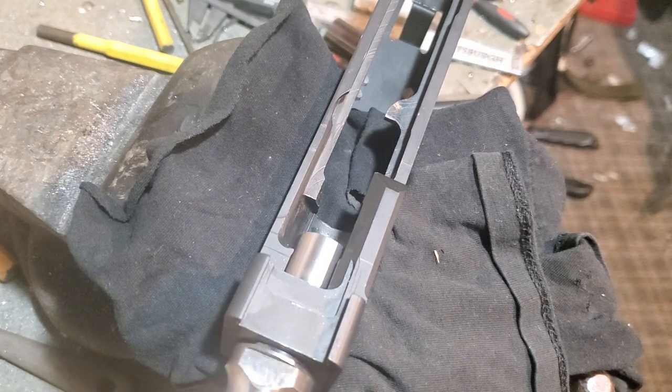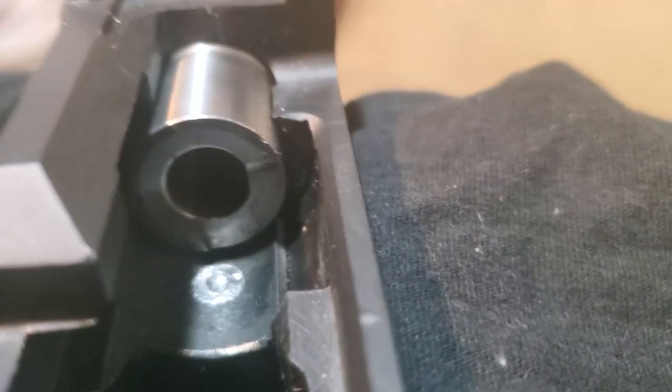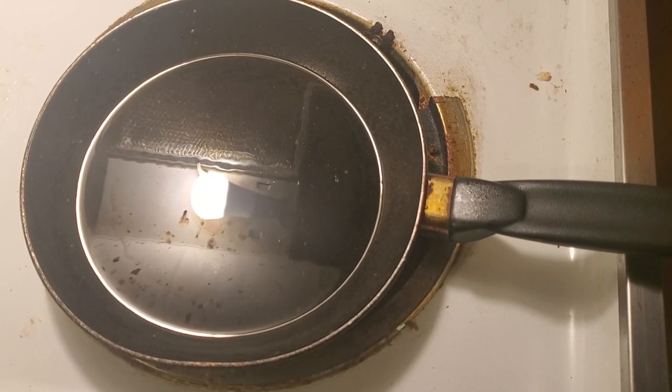I thought this was going to be just a drop-in barrel all ready to go, just torque it to whatever and it'll already be headspaced and everything, but no. Here I've got it hand tight, and the extractor cut is at 3 and 6 o'clock instead of 12 and 3. Torquing a barrel doesn't turn at 45 degrees. Something was wrong.